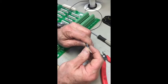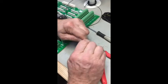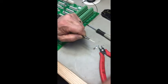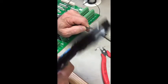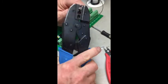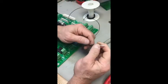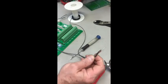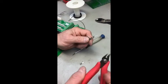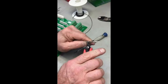You'll see that when we take the ferrule and slide it over the center conductor, it easily slides onto the wire all the way down to the first flute on the ferrule. Then using your ferrule crimping tool, open it up, put it on the ferrule, and completely close it. Let it automatically open and it will have crimped the ferrule onto the wire.